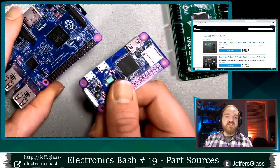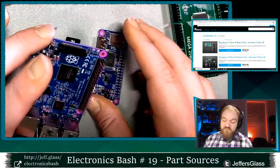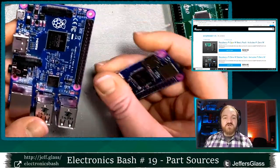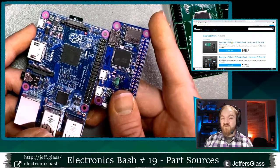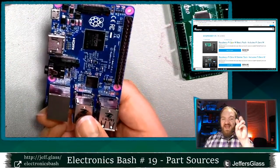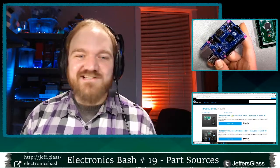Depending on how much of that you already have in-house, there can be a little bit of cost to getting started with these. But you may also already have one. This is a 16 gig micro SD. I think an 8 would be plenty, which are like $5 these days. If you had to choose which of these components to prioritize in terms of quality and reliability, the power supply is actually worth getting a decent one. For example, I'm running my 3D printer right now on an old janky 1 amp, 1.5 amp power supply, and it's not great. It sometimes dies. It throws me errors. It's underpowered. So buying the $8 full-size power supply is actually worth it in this case.